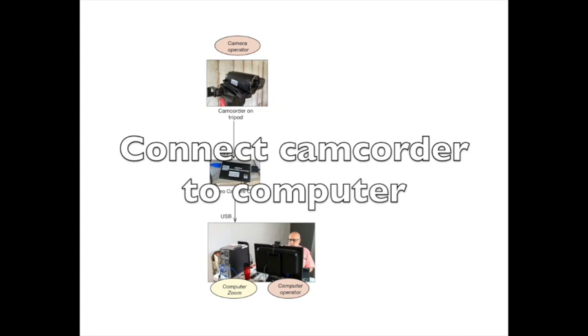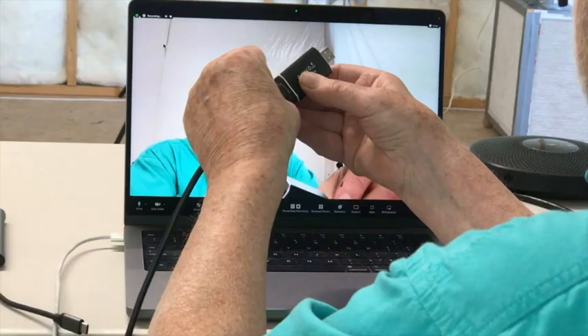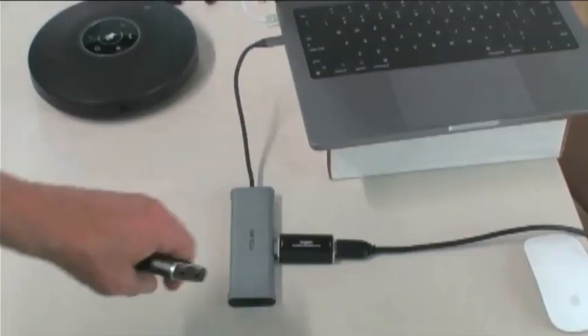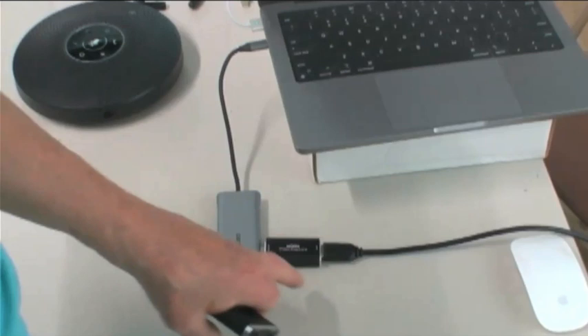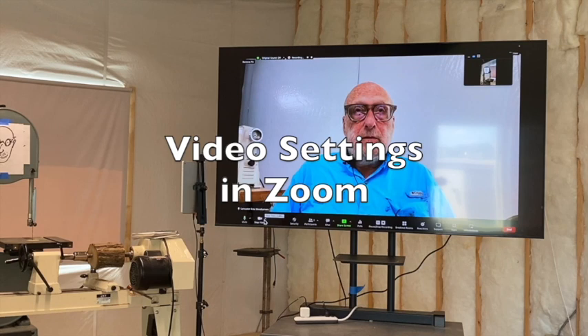The next thing we do is connect the tailstock camcorder. It's the same camcorder we had in the previous demo. However, the camcorder is connected to its USB capture card, which has a USB on one end and HDMI on the other. The HDMI plugs in, the camera plugs into the HDMI end, and the USB plugs into the USB port replicator, which plugs into the USB-C port on the computer. The HDMI signal from the camera goes into the video capture card, goes into the USB bus, goes into the computer.